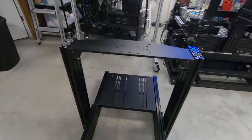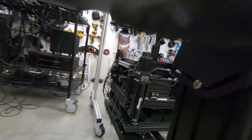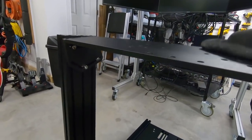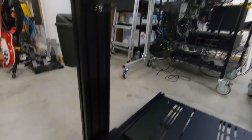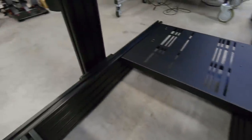The wheel deck is mounted now. I went ahead and used two bolts at the top and one for the bottom on each side, because I was worried about twisting action from the wheel. Having just one on top is just too easy to twist. Because we have this slot on the bottom, I'm still able to take this and adjust the angle up or down. When putting it into the uprights I had those not fully tight, which makes it easier to get things in between them. Now I need to go make sure I tighten everything up before we move on to the next segment.